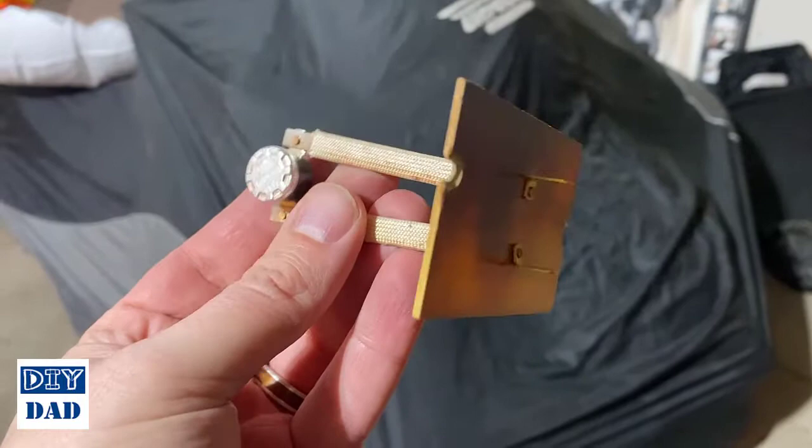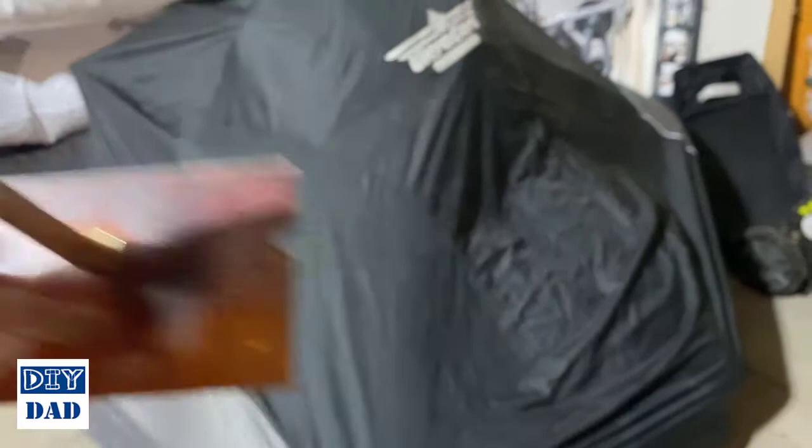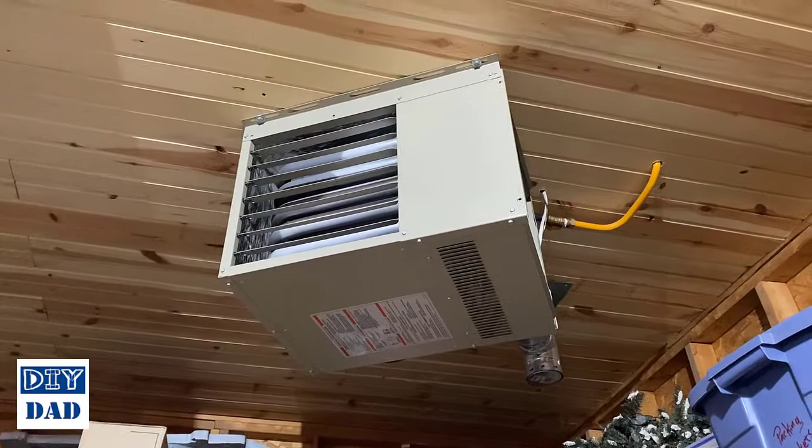Once you tap it back into cold mode, plug it back in and it will work again. The catch is, once it's started to fail it will fail again — I got about four days out of it after doing that. So I have a new one and we're going to get that installed through the sidewall with the wires reconnected. I should mention — before you do any work on a device like this, please make sure you've cut the power. I have a switch that shuts all power off to the unit. Don't be working on the inside if you still have electricity running to this.